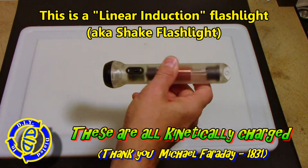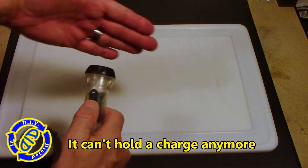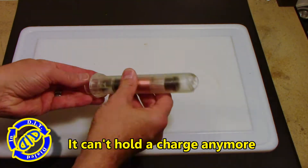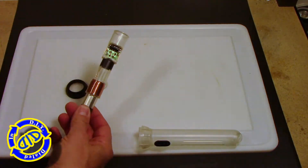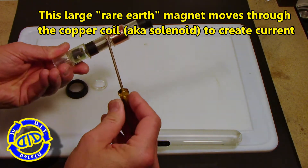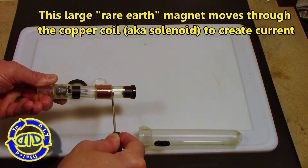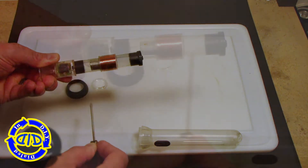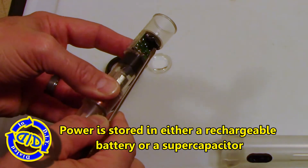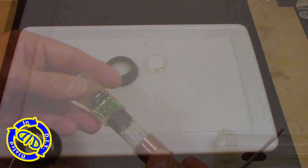They use conductive coils of wire and magnets. These shake flashlights are great — they work just like a shake weight that you use for exercise. However, this particular one won't hold any charge anymore. The way this works is really quite cool. There's a large magnet inside a tube that can move freely back and forth. It passes through a copper coil in the middle, and when it does, it creates current. That current is then stored as power in either a rechargeable battery or a super capacitor, and most of these shake flashlights use the super capacitor approach.